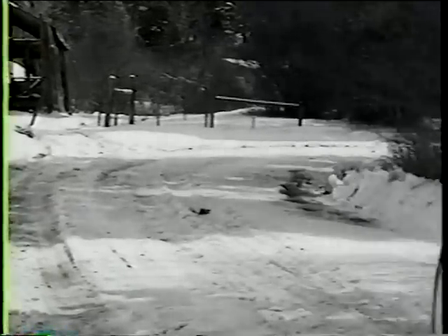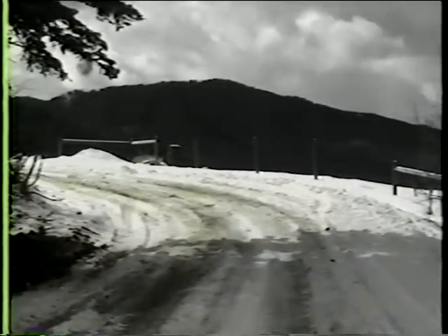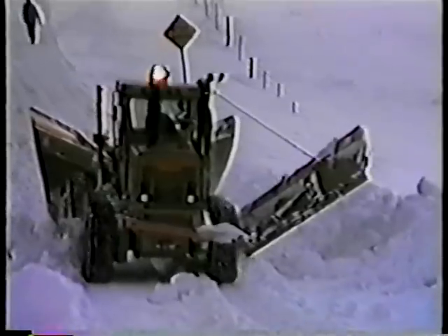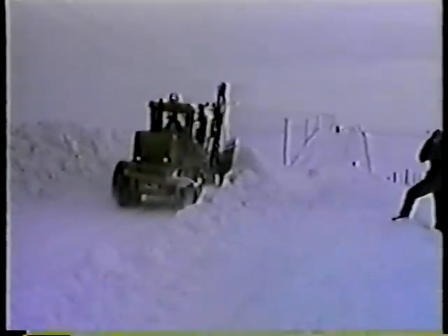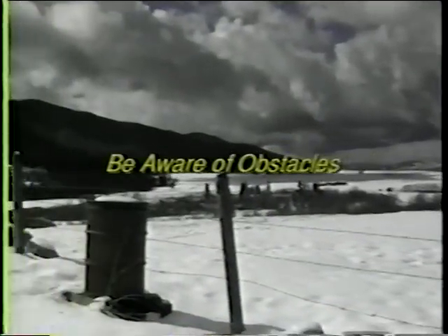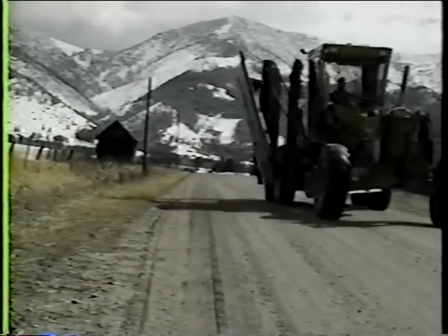Keep track of what you are leaving behind — you should see some of the road surface and some of the shoulder. Avoid leaving windrows to collect drifts. When using a V plow, avoid letting snow get over the V plow, especially downhill. Be aware of possible obstacles — for instance, guardrails that should still be there in the spring.